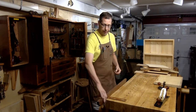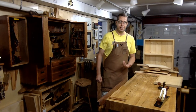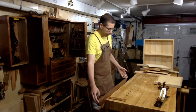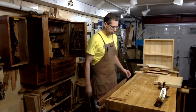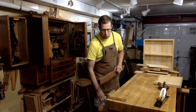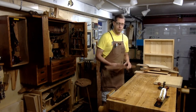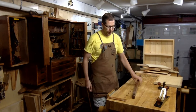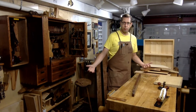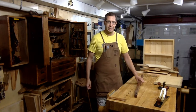So if you are building a straightedge out of wood in your shop, I would not obsess over it. This length, and if I've got a board that's super, super flat here, this length is going to give me so much more flatness than I actually require. Moreover, I wouldn't want to necessarily rely on this if I've got super, super long boards. Again, 8 foot long boards, 6 foot long boards. This will give me a good idea of the flatness.